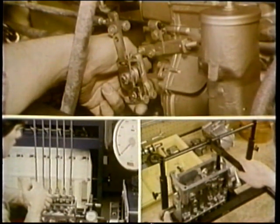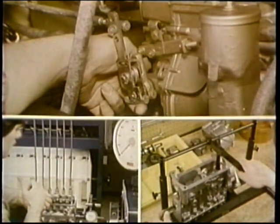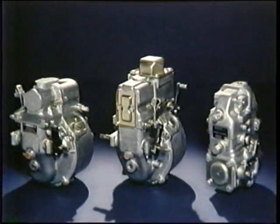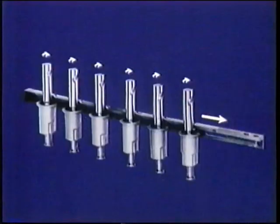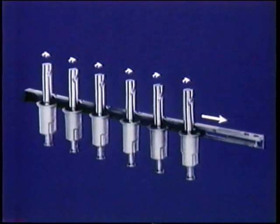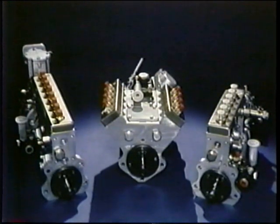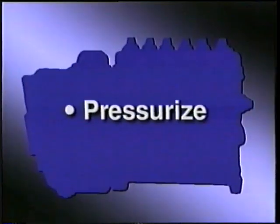How your measurements and adjustments affect the operation of the P-Pump. Of course, this pump can be controlled by different kinds of governors. No matter what kind of governor, it comes down to how the control rack is positioned to turn the sleeves and plungers. We'll cover that later. You may find yourself repairing in-line P-Pumps, even a V8. The 6 is widely used. They're really quite similar in the way they pressurize the fuel.